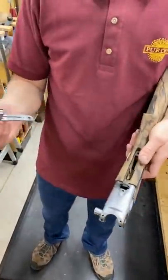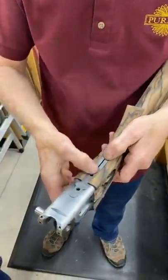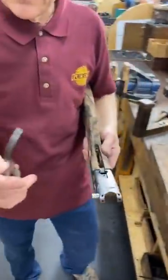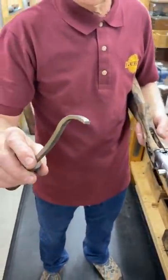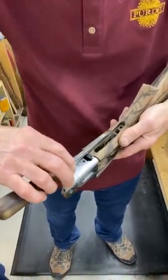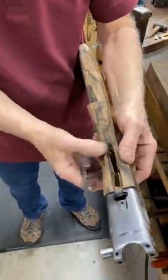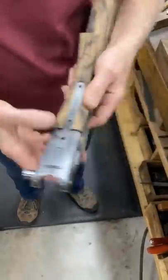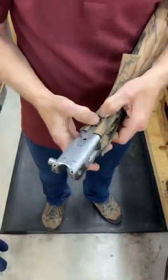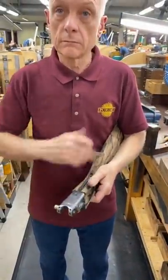Trigger plate, exactly the same, smoke black. Gently easing it down. Now we're using foot chisels like that. This is to get right down inside here and along inside this. So we're gently easing that trigger plate down now, until we get the right measurement through the hand. And everything is that sort of fit. So I'm not hitting this hard, and it's not loose or wide.